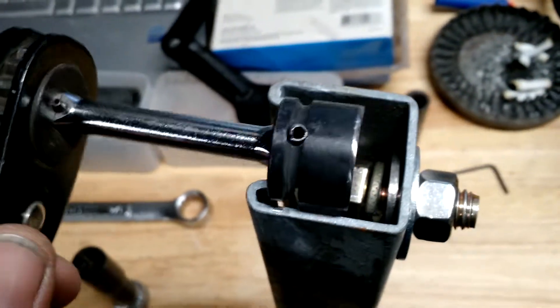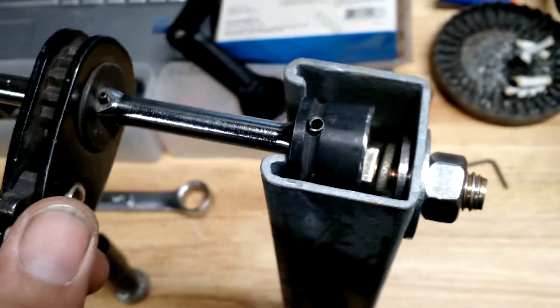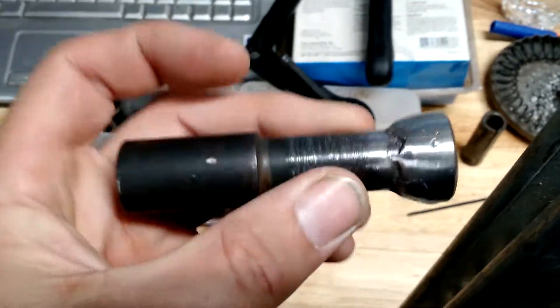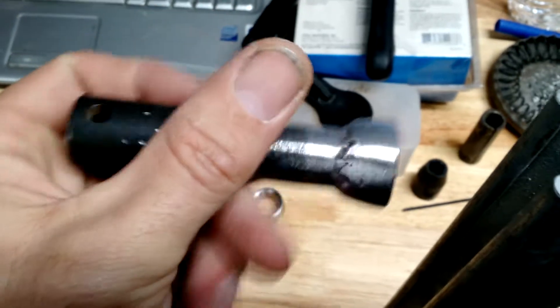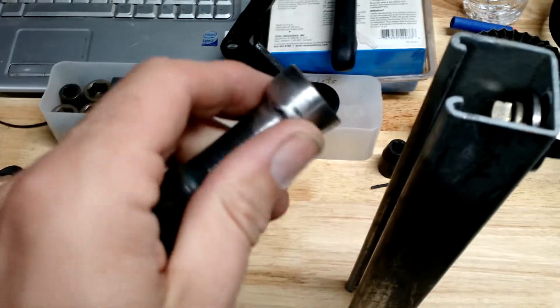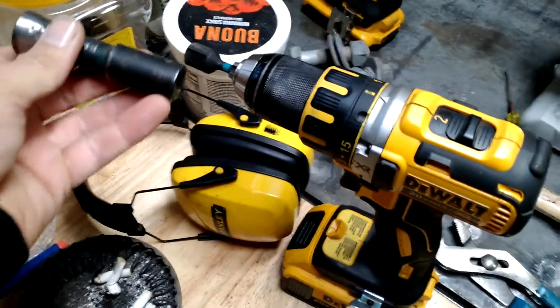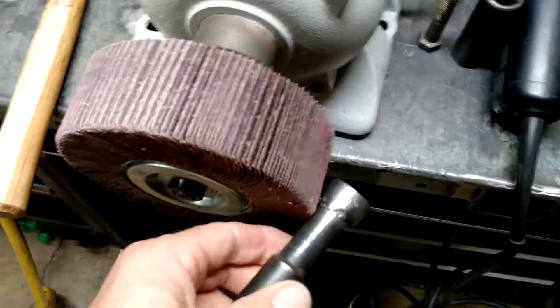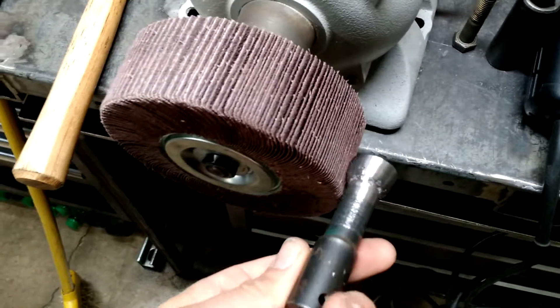It sucks if you actually got a lock washer and a regular washer on it, you're still fighting it in there. To the rescue is this guy — this is just the piece that was cut off that socket. I had to build up the 7/16ths, and after I built it up and welded it on, I kind of sanded it down, just threw the socket on the end of the drill so I could spin it. I took it over to the flap disc and made all sorts of fun.